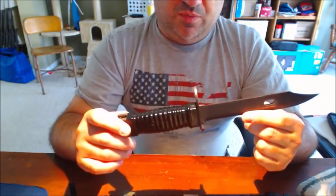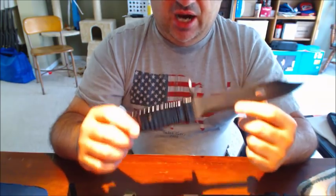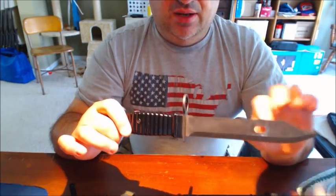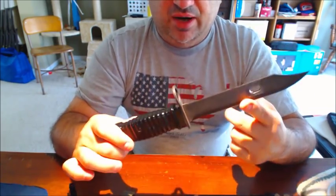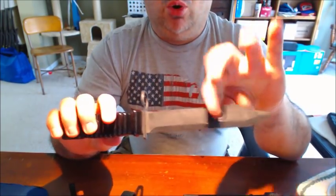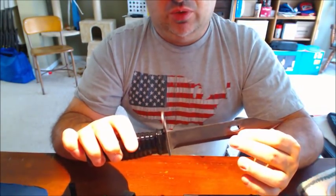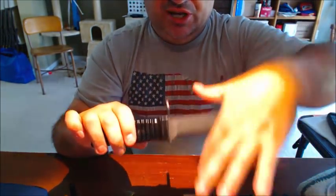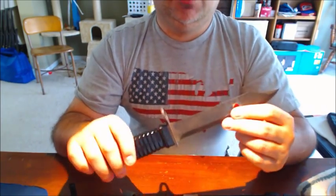Having a bayonet as an all-purpose camp knife really isn't ideal either, because it's a compromise. You're given a big window of opportunity for stuff to break. You put teeth on the back — another opportunity to break. There are things you don't do to a knife blade: number one, you do not put a hole in it; number two, you do not put notches in it. Jimping looks cool, but if you torque the blade it gives a crack a place to start, which migrates right through and snaps the blade in half.